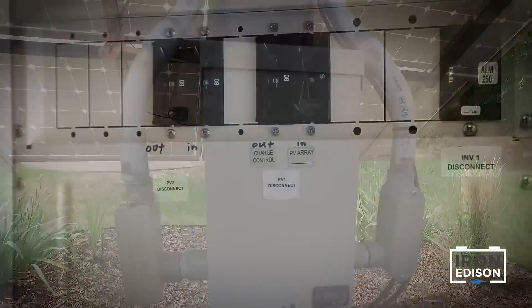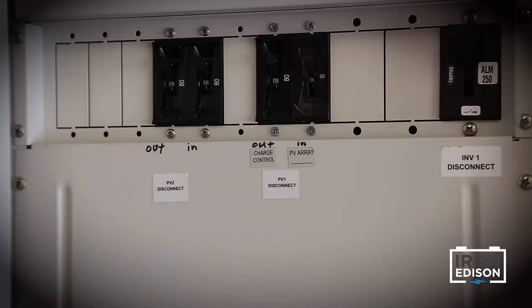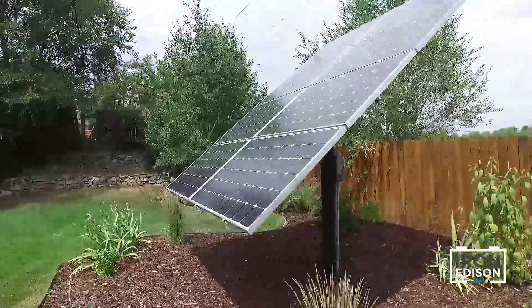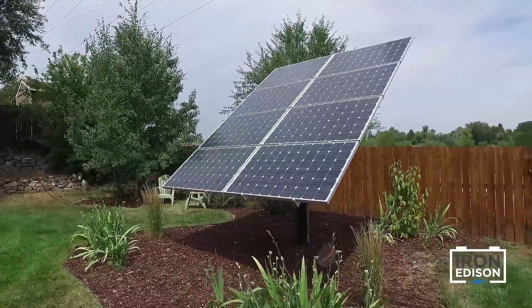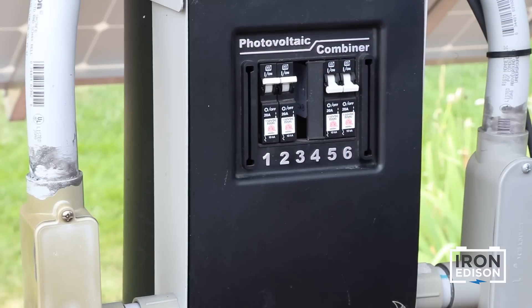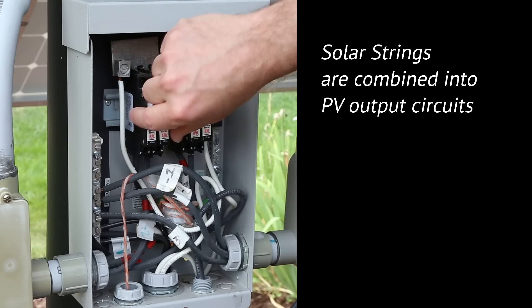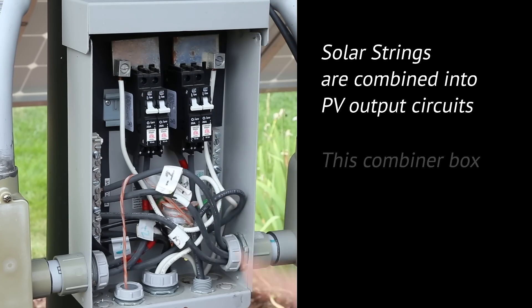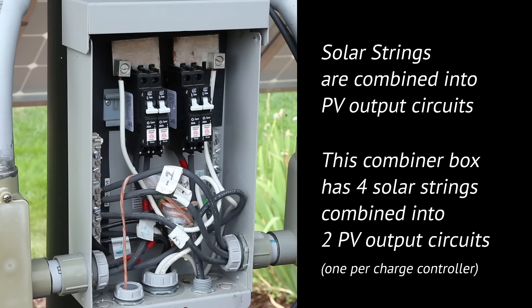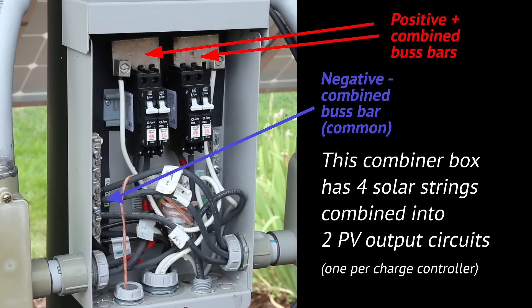This is the first of several circuit breakers you will see throughout the system. In most solar energy systems you'll find circuit breakers or a disconnecting means at both ends of the wires that connect from the solar array back into the power panel. The combiner box also serves as the site where each solar string is combined into one circuit known as the PV output circuit. Each string of solar panels is put into parallel on a bus bar inside this combiner box. By wiring in parallel, we're building the amperage on this PV output circuit.